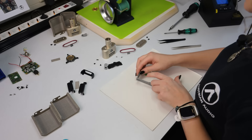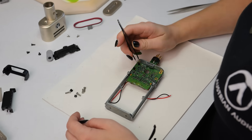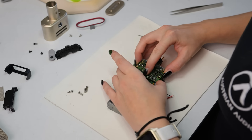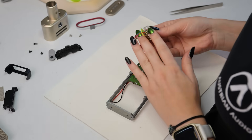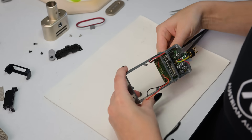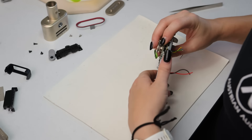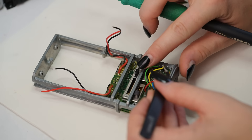We are finally ready to put things together — combining the circuit board and the capsule to turn it into a microphone. We'll add the switches and the connectors. Let's start by putting the audio board into the housing and adding spacers in between the two boards. Then we add the power board and some screws. Now this is the Mini XLR connector. This microphone is special — it has a normal XLR output and an additional Mini XLR, which means if you record both, you can decide about the polar pattern of the microphone later in the mix. There's even a free multiband plugin from Austrian Audio to help with this.